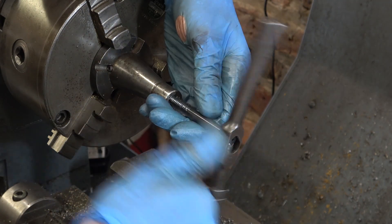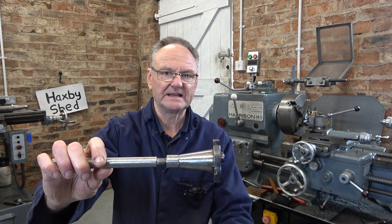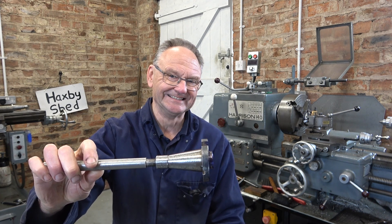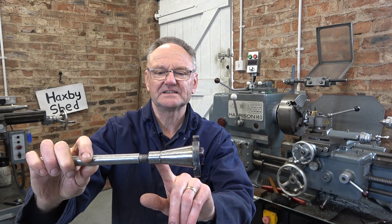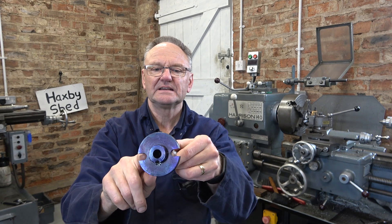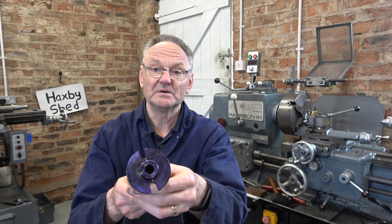So in a moment we'll try it in the mill. Well now I've cut that 12mm thread, it screws nicely onto the drawbar — this is the drawbar from the vertical milling head on the Harrison. Kind of looks good, doesn't it? Except I forgot the basic rule: assume nothing, trust nothing, check everything. Because when I came to fit this into the spindle, this bit is too wide, and those two slots there are not wide enough. So this almost certainly is homemade or it's made for something else.